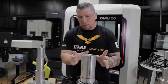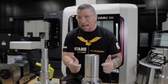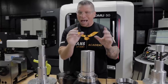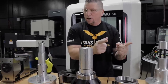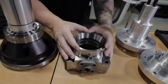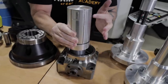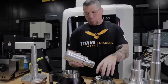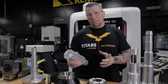One of the critical things we had to think about was that once we finished machining on the lathe and made sure everything was perfect, we had to take the exact same part and put it into the five-axis machine. You have 40 to 50 thousandths walls and absolute positioning — everything has to be absolutely perfect, and now you're putting it into a different setup. So what did we do? We duplicated the exact setup in the lathe by going to a different Royal chuck that held the exact collet. We simply mirrored the setup, then indicated the mandrel perfect to the chuck and to the table. That's how we created a custom mandrel and used it with the Royal Quick Grip Collet Chuck.